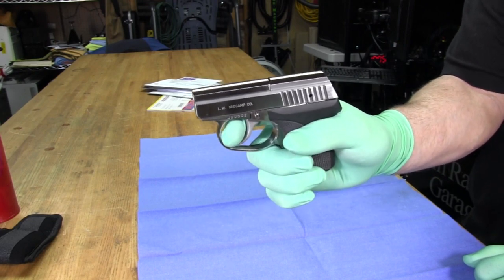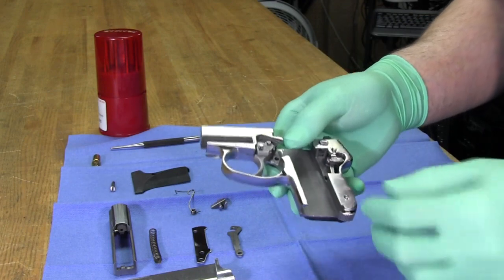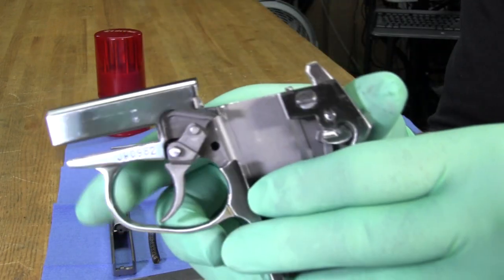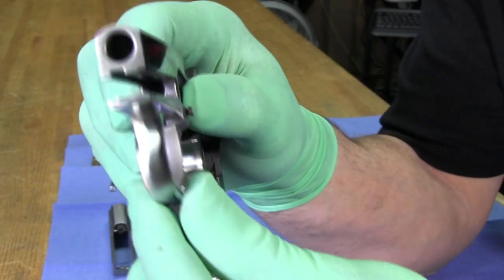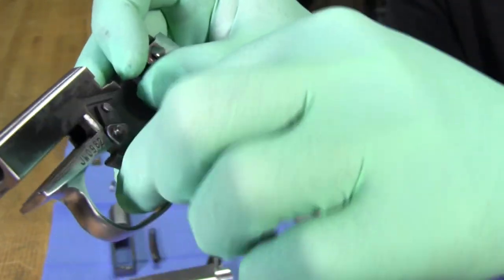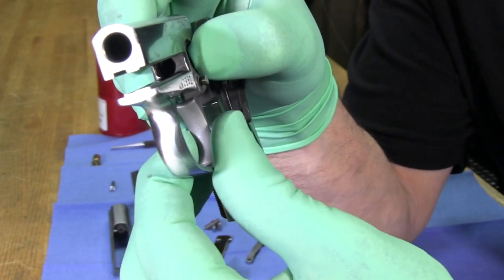Now we don't have any hang-ups. Let's take a look at what was causing that sticking trigger. I was looking at just about everything on this pistol trying to find out what the problem was. I inspected the drawbar, the side plate — everything — looking at what could possibly be causing the binding. And I want to show you here — this was always my suspect — this play that we have in this trigger. It's just the way it fits on, from the hole in that trigger to the pin that's on the frame. There's a lot of lateral movement there. It feels worse in your fingers than it really looks here, but there's just a lot of play.